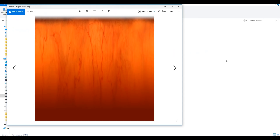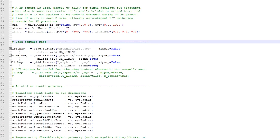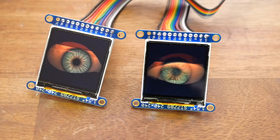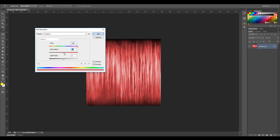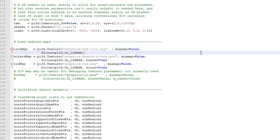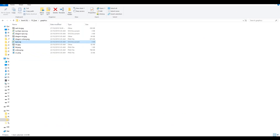Here is the default iris, as well as the sclera, and then there's the dragon version of the sclera as well. To select one of these, all you need to do is enter the file name in eyes.py. I amend the file name, boot up the Pi, and you can see that the sclera around the eyes has now changed to the darker, more bloodshot version. I opened the standard iris file in Photoshop, played with the hue and saturation, gave it a bright red color throughout, and then saved the file as red-iris. It doesn't really matter what you call it, as long as back in eyes.py you update the file name to match.